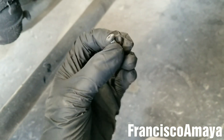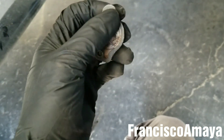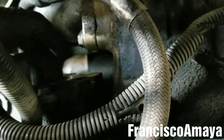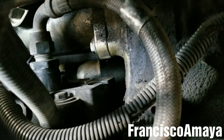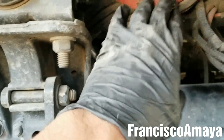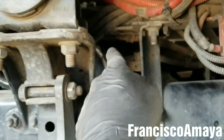All you have to do is remove these T25 bolts that are holding this plug — this little bracket, this little cover — and it has a gasket. In this case the gasket was stuck on the cap, but in some cases it gets on the compressor and that's super hard to remove. This is a 2010 Freightliner Cascadia and we have room, but if you have a 2013 and up, you don't have room. Everything is covered with hoses, cables, and brackets, and that little piece is super hard to remove.